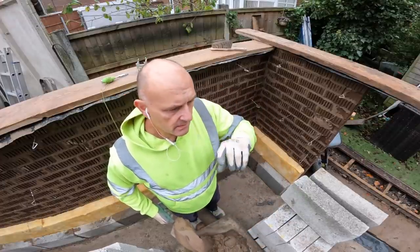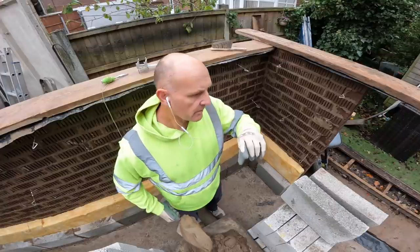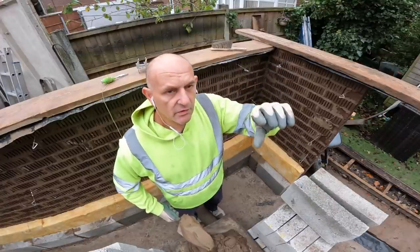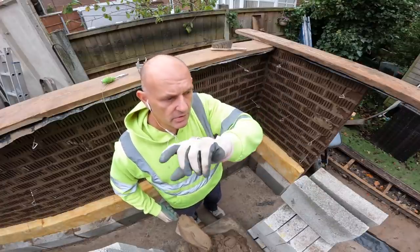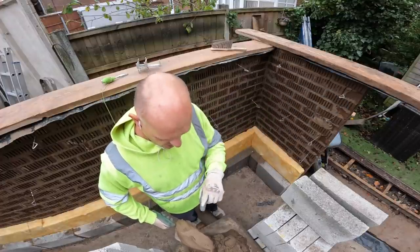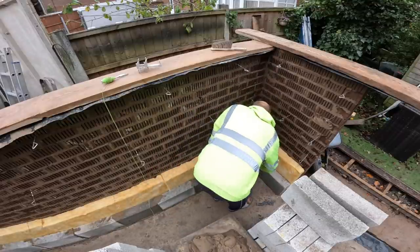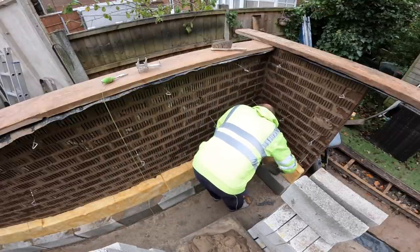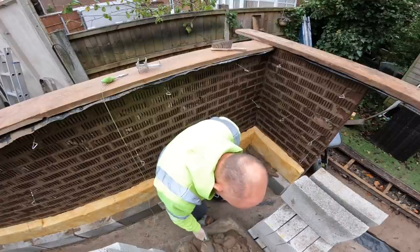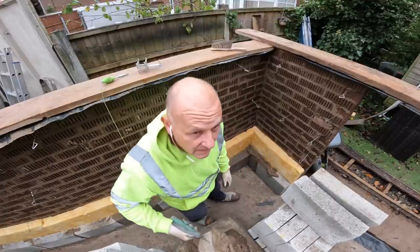Big beds, because our brickwork beds are 77.2, so we need big beds on these. We've lost the course of some brick, only 27 to lintel height, so it's big beds. Nice stiff mix.